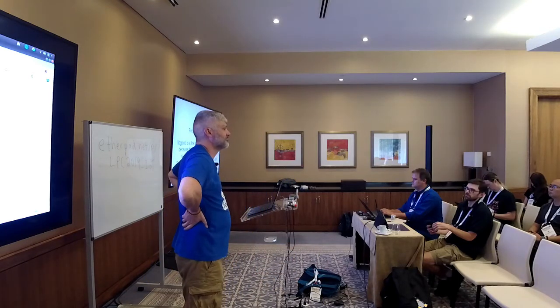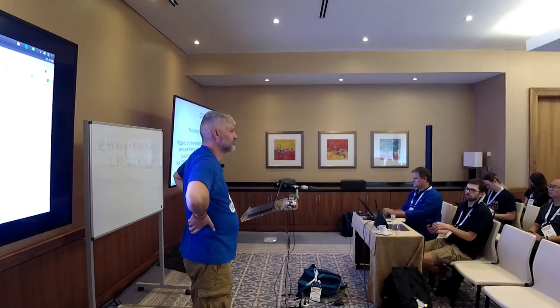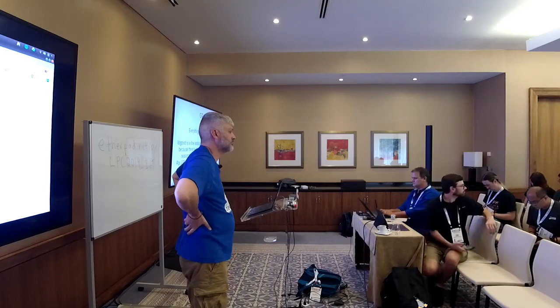On that note, I did a fair bit of research into GPIO recently for the last couple of projects I'm working on, and actually dialogued quite a bit with Linus, who made the large change for GPIO chip. And it's not just that the old API is very simple to use, it's that the new one introduces a bunch of paradigm shifts that people are not used to, and especially for distributors who just want to get their hardware out there, they don't really have that incentive yet to jump on the new kind of API paradigm.